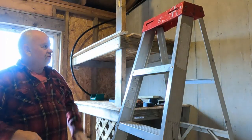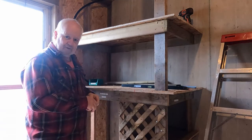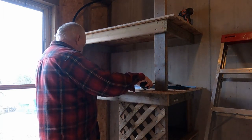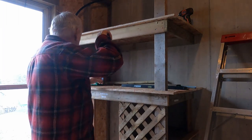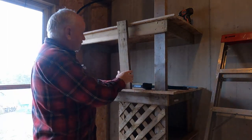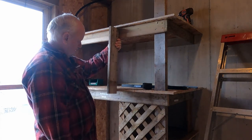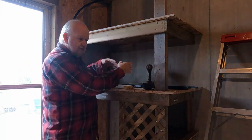I'm going to put some screws in there to hold it down. I want to put some dividers in here — if I leave this wide open it would be too much of a clutter and I won't be able to sort through the wood. This opening is 39 inches, so I have 13 inches per section: 13, 26, 39 — that ought to do it. I found one piece of 1x4 that's longer than 19 inches, so I'm going to rip this in half to make my dividers. I'd also want to put a couple of dividers at the back to separate the compartments.